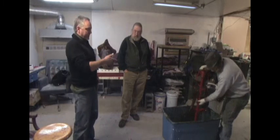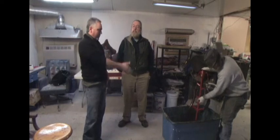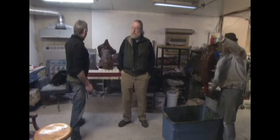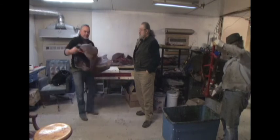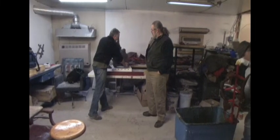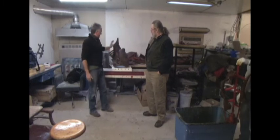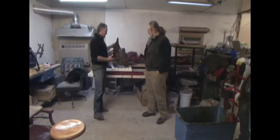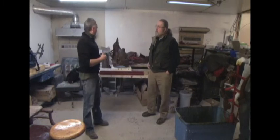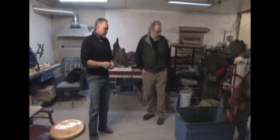Once the camera swings around, you'll see that the pieces Katie has leaning up against the wall are at the stage before what we're doing right here. First, Yuri gives us the patterns — as you can see with this head, 'Dear Isaac,' in a developmental form that hasn't been sprued, that came to us straight from Yuri's studio like this. The next process will be to go to Katie where it will be sprued, given the plumbing, to withstand the forces of the process and also to distribute the metal throughout the casting evenly and quickly.